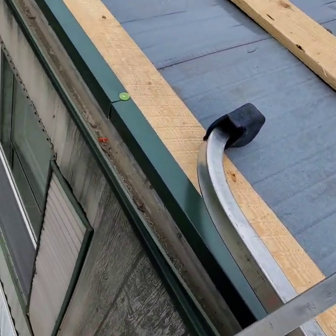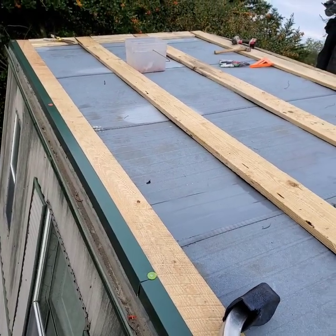So the next step to this process in the single wide installation is to prep our metal panels. I'll show you guys how we do that real fast. So my screw line is going to be 7 inches on the bottom for every rib, and then my next step up is going to be 2'7" first and third rib, and 4'7" first and third rib of each panel. So I'll go ahead and mark those and dent them, and then I'll show you guys what it looks like.